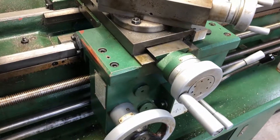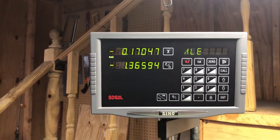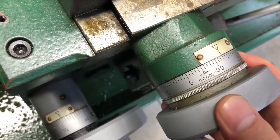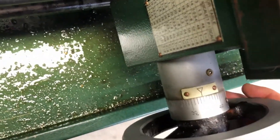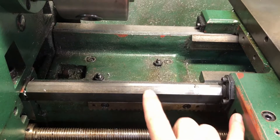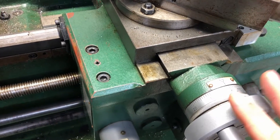The first accessory I added to the lathe was the two-axis DRO up here. Using the dials was okay for a while, and like many of you running lathes like this, it works — it's a little tough, but it's doable. Both axes, you've got backlash to deal with, things like that. So what I did at first was make things to go on here with indicators to see where I'm at, and that worked for a while, but I really wanted a DRO.